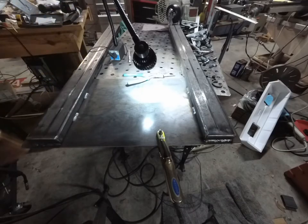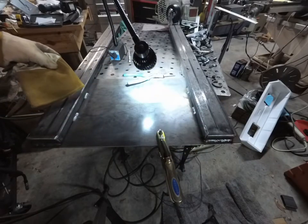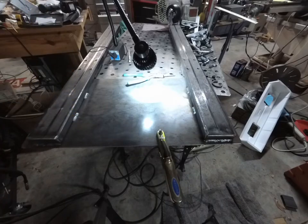I got it all welded up. It's upside down on the welding table. I'm putting some little welds here and here and here and here. The weird thing is I measured and still got these things out of line — this one's like four inches from up here and this one's like three inches. Do I care enough about it to grind it? No, because no one's going to climb under the cart and check. The welds actually look pretty good — they look like they tie it in there nicely. No cold welds or anything like that. It's reasonably pretty, and unlike the ones on the inside, the outside ones are symmetrical. So I'm basically done here — if I ever find fasteners to put this thing together, there's very little left to be done. I just have to fabricate a bracket for the front, which is one piece of metal with a couple of holes in it.